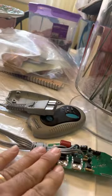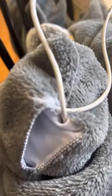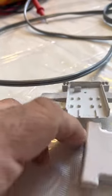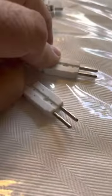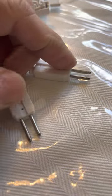Let's say everything works fine — the power wire is good and the wire going to the blanket is good. The next step is to open up your blanket, just barely cut it enough to pull the cover out. It's just one screw holding it, and you're going to find two leads inside.